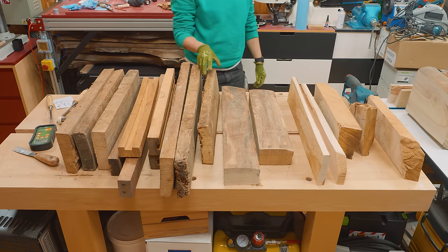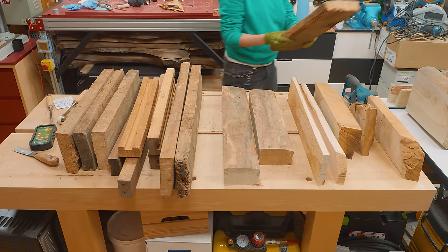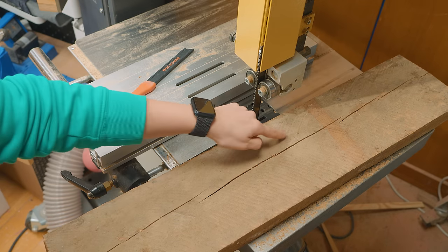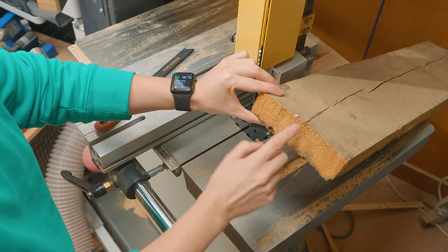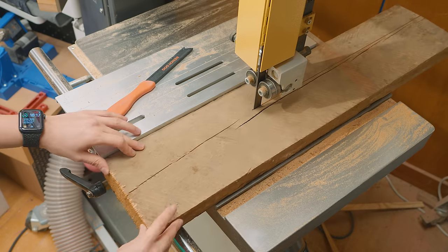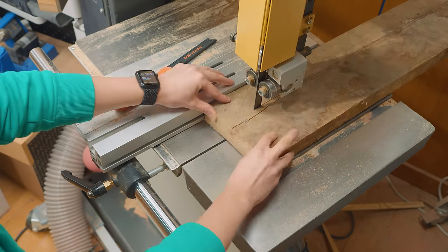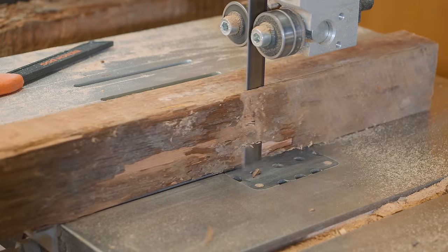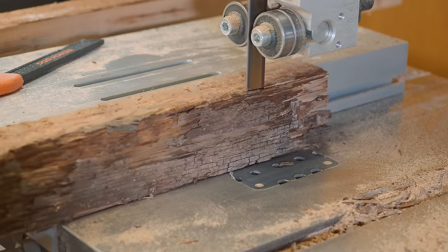I moved into prepping these old pine planks. The point here is to make the wood as stable as possible. I started by removing the pith, which is easily spotted by the cracking along the grain. This is the tree's center, as seen from the small diameter rings here. It must be discarded since the plank will always try to cup in this area. Some of these boards looked really disgusting and had some old bug damage, so I had to get rid of that outer layer.